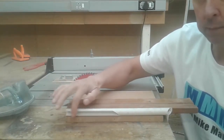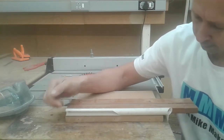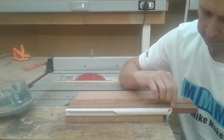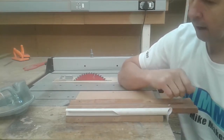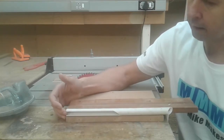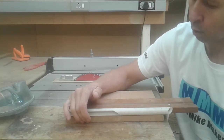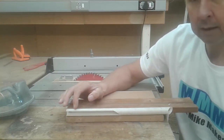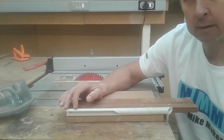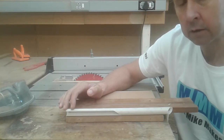You can either do a small cut so that you can put a screw into the conduit, or you can just cut it at an angle on your mitre saw and put a screw in as well. I've distanced this 15 millimeters off the edge of the board, because you want your clip to be less than 16 millimeters — you'll see why shortly. So I'm just going to do this cut quickly and then we can go from there.